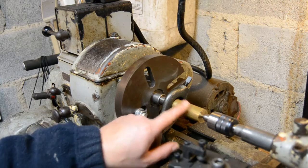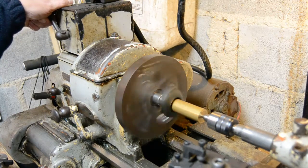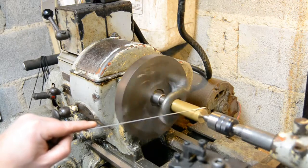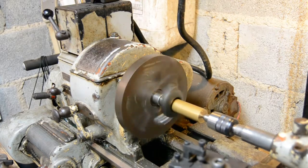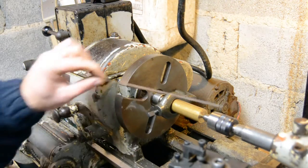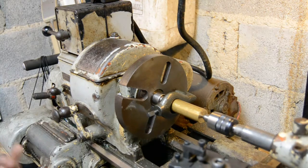We've got a roughly centered piece of bar. The center drillings were done by hand, so there could be quite a degree of inaccuracy. We're going to turn it on and see if we can pick up any vibration — and yeah, if you watch the top edge along here, you can actually see it going up and down a little bit because I haven't drilled that center as accurately as I should have done. But that doesn't matter. What we've done when we set this up is that between two centers we have produced an imaginary centerline — exactly the same as you would see on a drawing of any part — and that centerline, because we're held between centers, will be fixed. So any machining work we do while it's held between centers will be concentric.